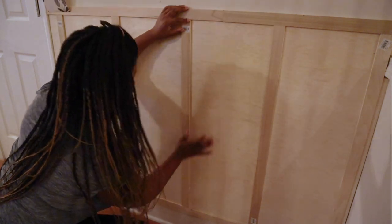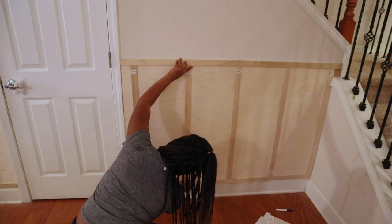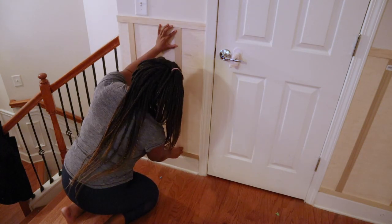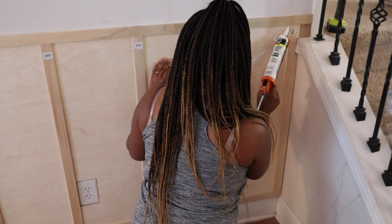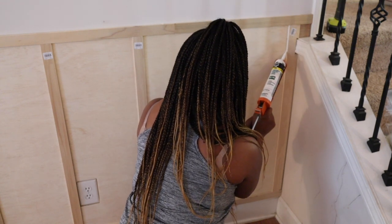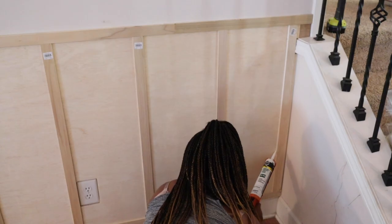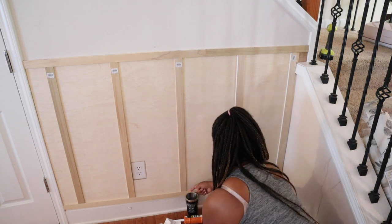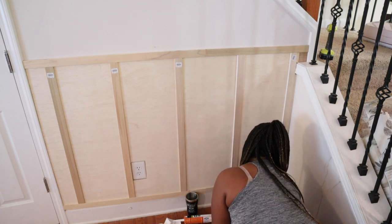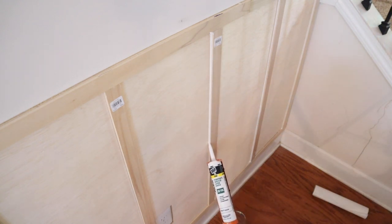For adding the vertical boards to the plywood, I used liquid nails instead of the glue gun, because liquid nails gives you wiggle room to straighten pieces if they're crooked. You can definitely use a laser level or a regular leveler to help with this. Once I got all the pieces up on the plywood, I let everything dry overnight. The next step was caulking — I was a little nervous but it's pretty easy. You cut the tip at an angle and have water nearby so you can smooth the caulk with your fingertip.